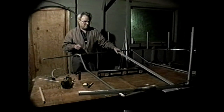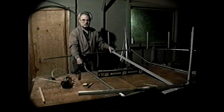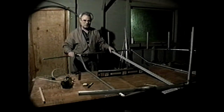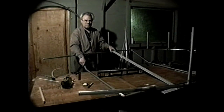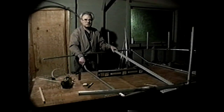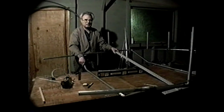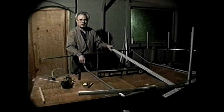After you've assembled the 4 elements into 2 hoops, then the next thing is to place these bars across the back of the guard. This is the rear hoop on the guard. Place these bars across the back of the guard and shape this assembly so that it's a little bit lopsided, because remember, the thrust line on Prospector is set over to the left by about 1.5 inches. I would maybe make the guard lopsided by 1 inch and then set it to the side by another 1/2 inch to line the propeller up.